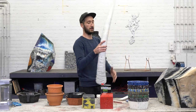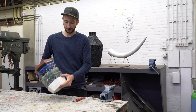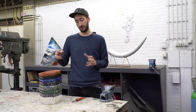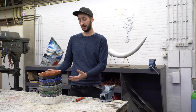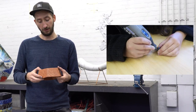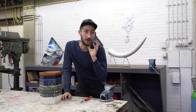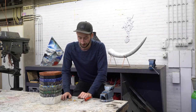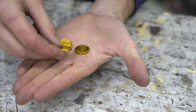It's a very labor-intensive, crafty way of working with plastic, but it does give nice results. As a production technique it's going to take a while to make it this smooth every time. Once you've made your object, whether it's hard or soft plastic, you need to mark it to show which type of plastic it is. This is important because if future generations want to recycle it, they can see which type it is and know how to treat it. There are several ways to stamp your plastic: you could hammer it in, use a Dremel tool to engrave it, or even a paper clip like people in the forums did. We've been really working hard to find a way the entire Precious Plastic community can mark products easily, affordably, and consistently — and we found a pretty solid way.